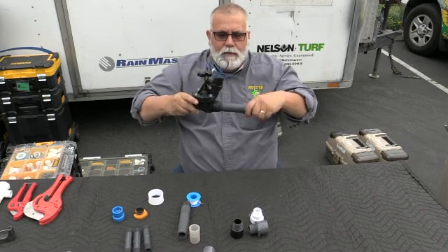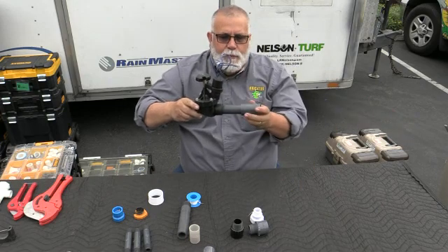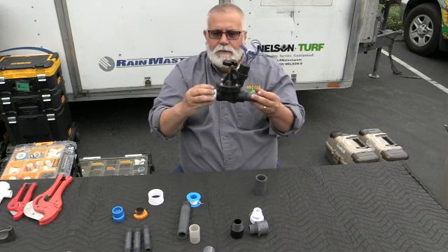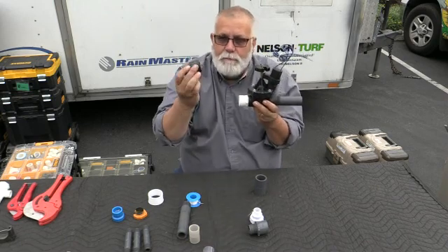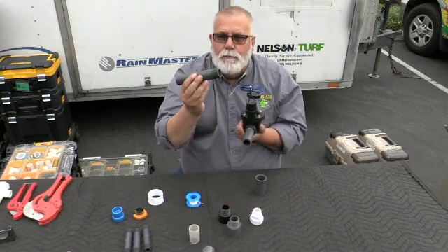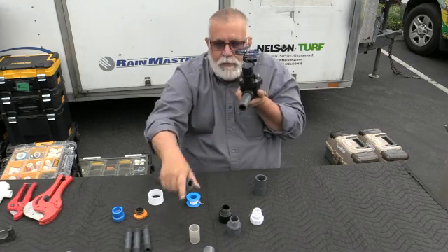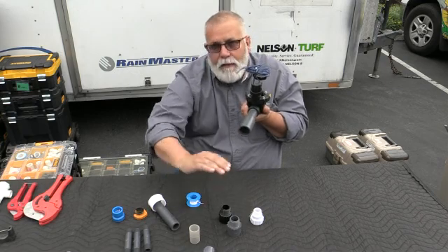I'm going to put this here. Or I can take a 45 and 45 it straight down out of the valve box and go right to the line. But if you just want to put a coupling or a ball valve, that's how you stick it in. This is on the downstream side, so you can do that on both sides. You can use Schedule 40 PVC, Schedule 40 black material, Schedule 80, or your toe nipples by just buying a Schedule 80 nipple at any of your local distributors, cutting it to the desired length, and putting a coupling on it — Schedule 80 or Schedule 40 — and having it 45 down and go out.